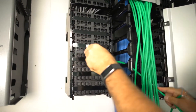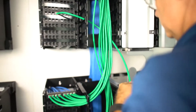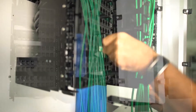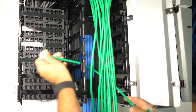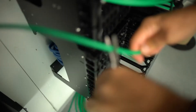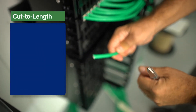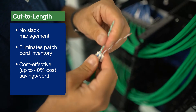The main characteristic of this new system is that it can be managed without using any special patch cord. Typical 110-style wall mount systems use blade patch cords that connect to the IDC blocks. The RevConnect 10GX wall mount system uses what we call cut-to-length management, which consists of using the RevConnect core to assemble jumpers in the field.